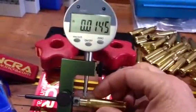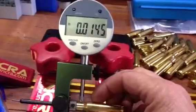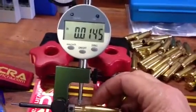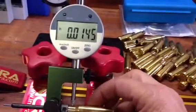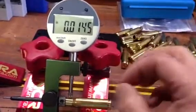So here's a piece of brass. As I move it, you'll see the numbers jump. Now remember, the number we see — the five — that is a hundredth of a thousandth of an inch, and it really shouldn't matter. Only a dial indicator can actually be honest there. So as I'm turning this, you can see that it ends up in the same spot. The numbers are jumping as my fingers touch it, but it is incredibly consistent in terms of thickness.